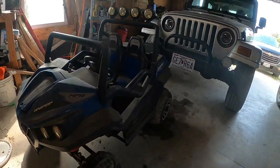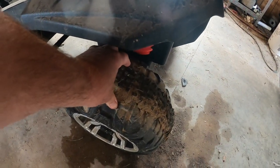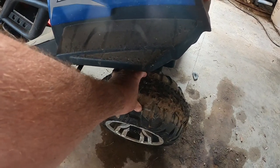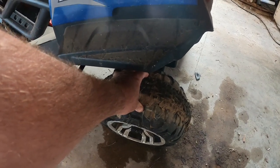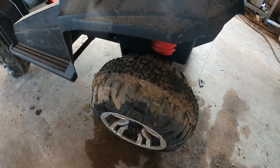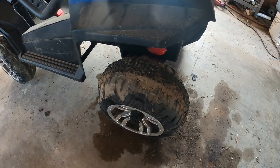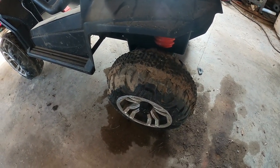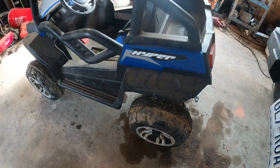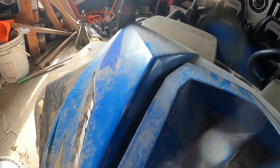One of the first things I do - it's a little dark in here, hopefully you can see it - but the back wheels get to where they basically have no traction unless they're on pavement. So I take mountain bike tires that I buy at Walmart, Amazon, just wherever I can find them cheap, and I cut them to the wheel. I put it around the wheel and just take wood screws to attach it on. That gives them traction - they can drive pretty much anywhere a four-wheeler ATV can go on the farm. They can cross creeks, go pretty much anywhere, if they've got the power.